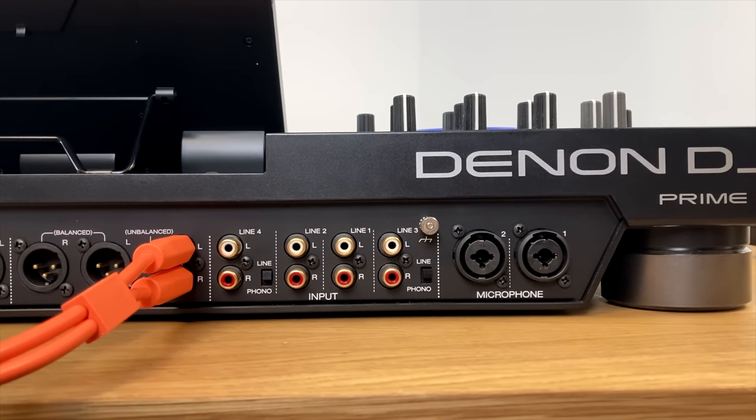There are some very nice headphone controls here. The phones knob decides whether what you hear in headphones is only the tracks you've pressed a CUE button for, or the master only — in which case the CUE button won't work — or a mix between the two. It can be very useful when DJing without a good speaker near you, to mix the two and hear what the crowd are hearing alongside what you're cueing, to check they're in time. The volume knob here is simply a headphone volume control.